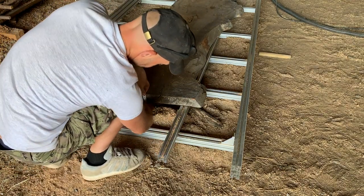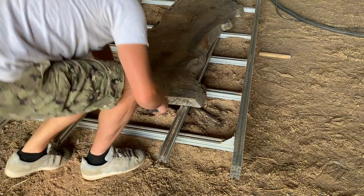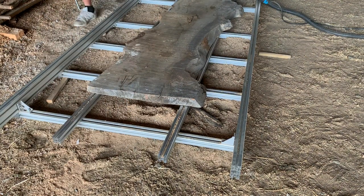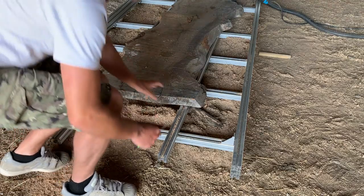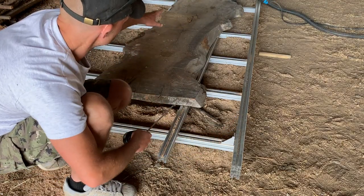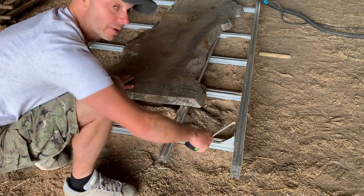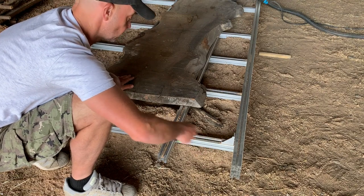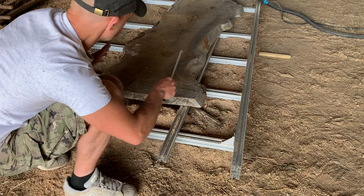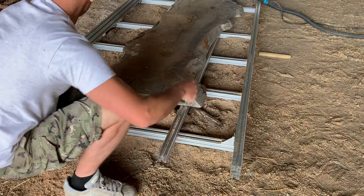So this slab is 52 mil. With the Take One Two, you can actually get to probably just about 120, 110 mil slab directly if you're using an 80 mil rail, because the Take One Two mounting system is above. My one was directly on here, so I had a maximum of about 78 mil, which I could flatten. So this does two purposes, stiffens it up, as I say, gives more strength to the whole thing, but they can move away, and it also keeps rigidity.